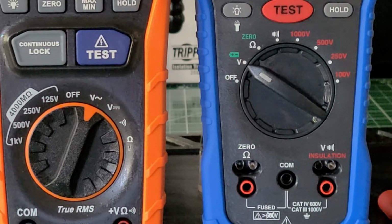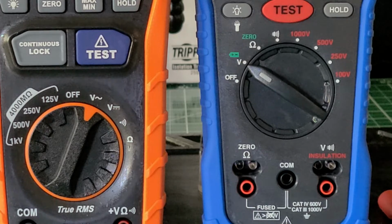Okay, it's auto-ranging, it's true RMS, and has a backlight display with bar graph, auto power off, high voltage, min max, and hold icons, a low battery indicator with easily replaceable batteries and fuse, a built-in stand and optional magnetic hanger for hands-free operation, test verification of conformity to EN 61557. It says Cat IV rated 600 volts and Cat III rated 1,000 volts safety rating. Also, it says it is made out of polycarbonate with electrical components.